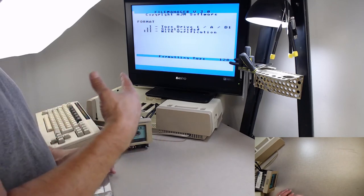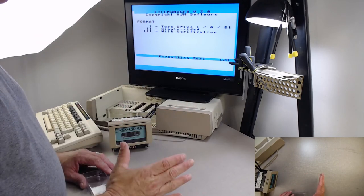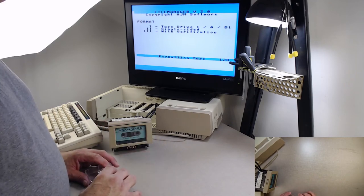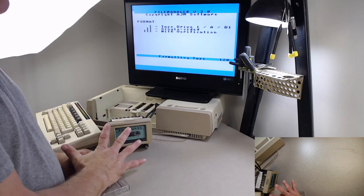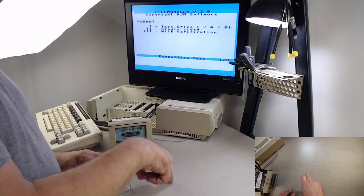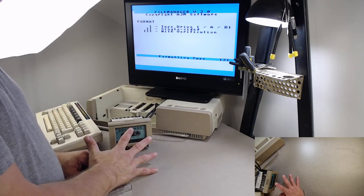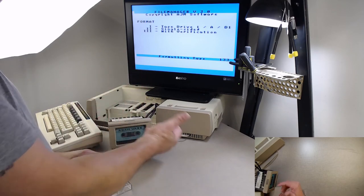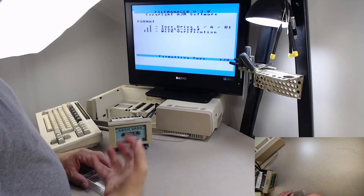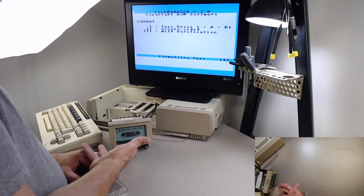It's going to rewind. I usually get CRC errors on the back track. If you start getting CRC errors, that means that it's not reading correctly. It comes up and tells you, you want to ignore it, and you can ignore it. But if you keep getting a CRC error over and over again, one block after another, your system is not writing correctly. The data drive is not writing to tape correctly. What it's reading off is garbled. And sometimes that ruins the data pack, because not only is it garbled, it overwrote the indexing too, so that's garbled, so you can't even reformat it.